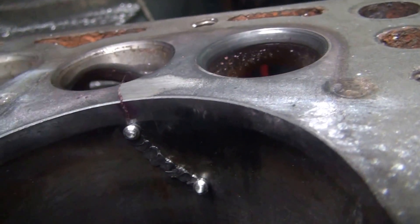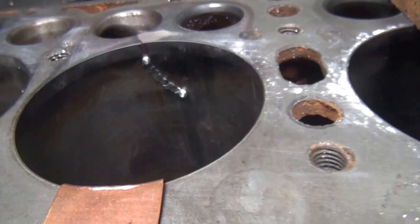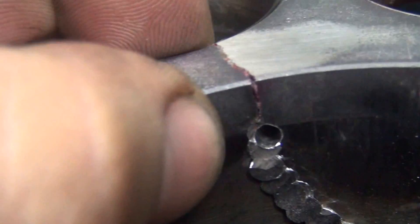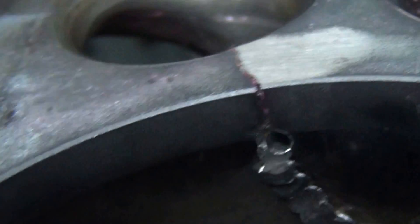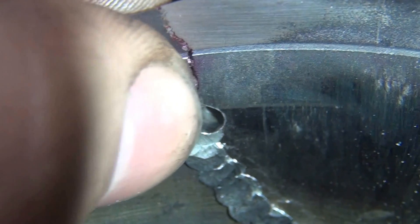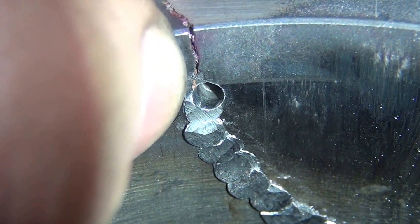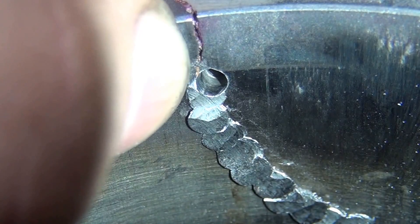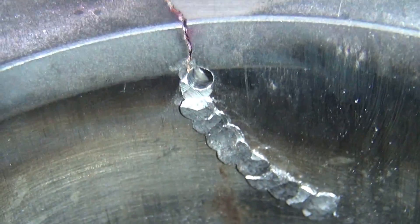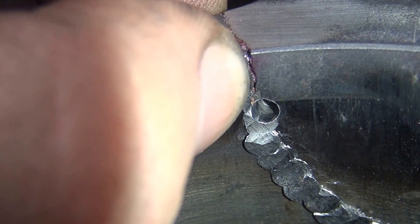Now we'll go back up here to the top and look at changing out these pins and try the other style. This drill walked way off center when I hit it — you can see where I started drilling here. Right at the top of my thumb is where the drill started, but by the time it got the hole in, it was way over here off the edge of my crack. I pretty much went completely off where I was supposed to be because the drill walked over on me since I was drilling at an angle instead of going straight. So I'm going to come back and put another hole on top of this one.